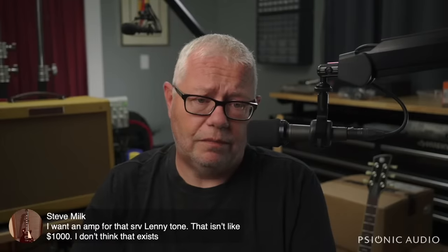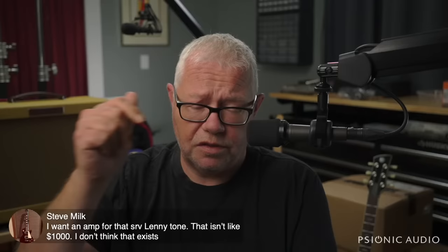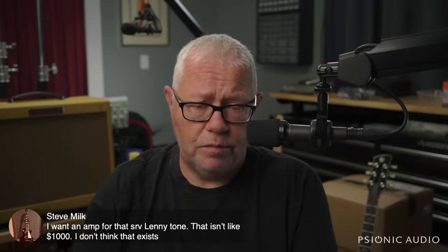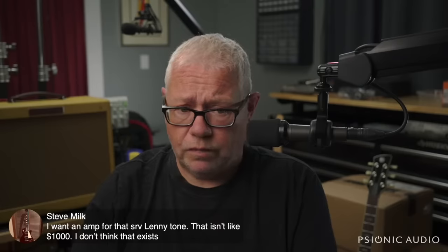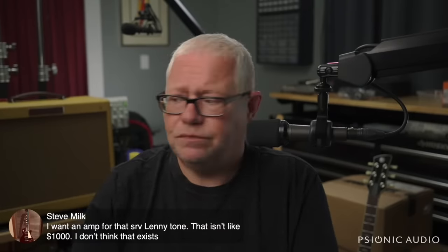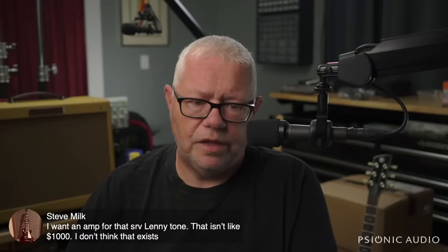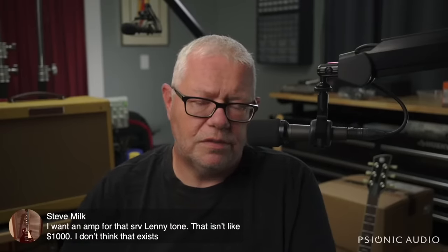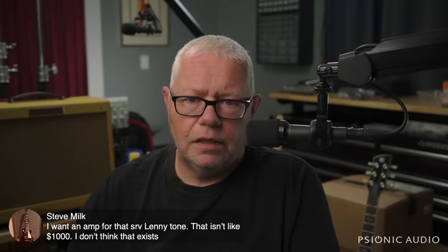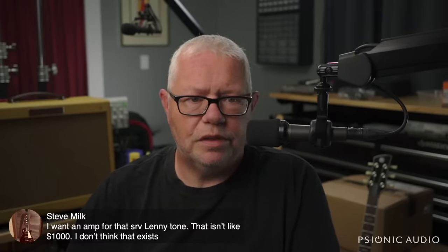You can do that. You can get a Deluxe Reverb reissue, do the $200 worth of mods I've discussed already, and replace the 6.8K resistor for the mids with a 1.5K, and you'll sound like Lenny all day long. Lenny's one of the things I bust out of habit on the Strat all the time. I'll do that or Yellow Ledbetter, and a lot of amps will do that. The variable is, to sound like Stevie Ray, you need to have been Stevie Ray.